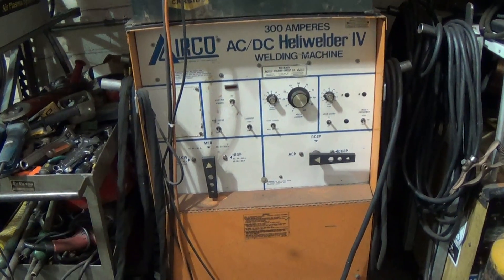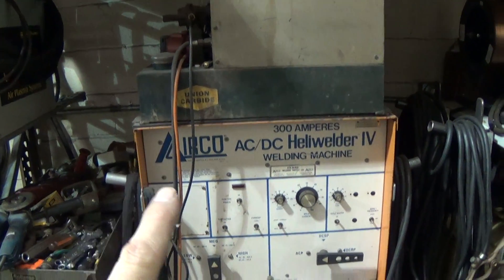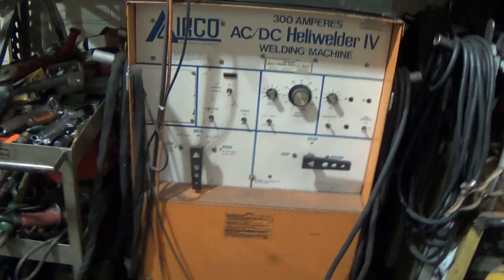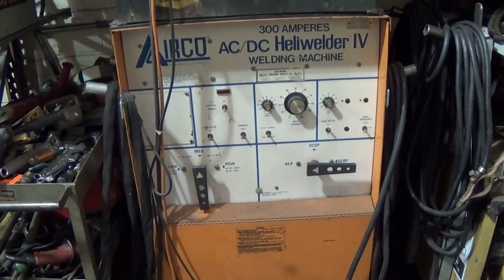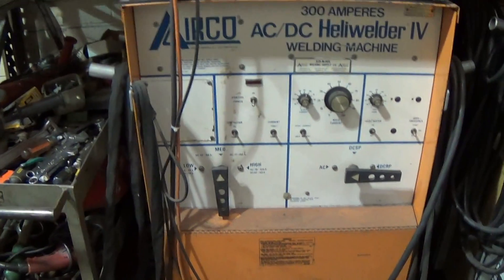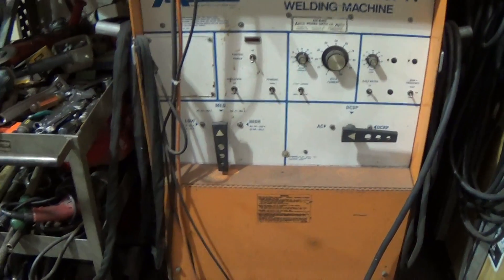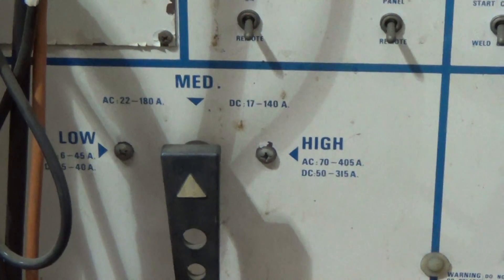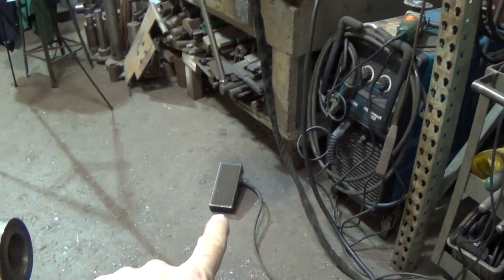Before I start and turn on that incredibly loud TIG cooler — I know people always ask me about the parameters when I'm welding something. They want to know the amps or volts. So this would be a heli-arc situation, which is a CC process — constant current. I will be in AC mode, and I'm going to be in the medium range of my machine, which should be anywhere from about 30 to 170 or 175 amps. That'll vary because I'm using a foot pedal, so I'll probably be right around 80–90 amps.